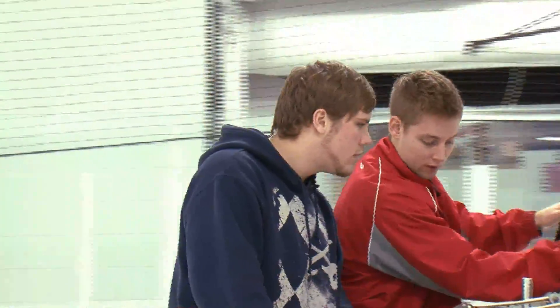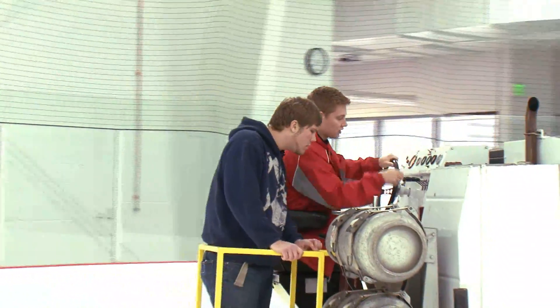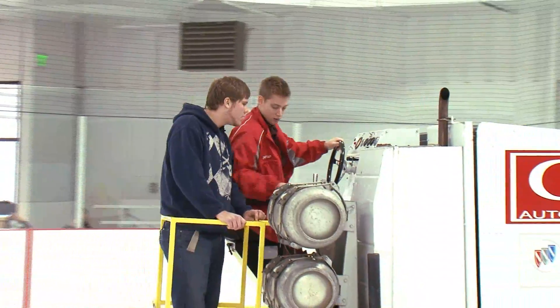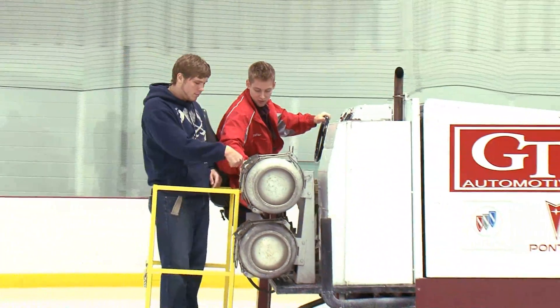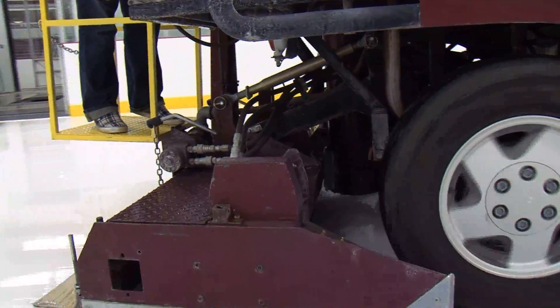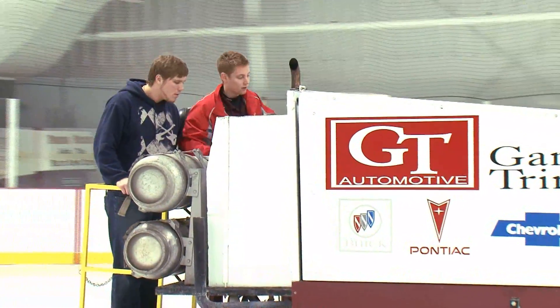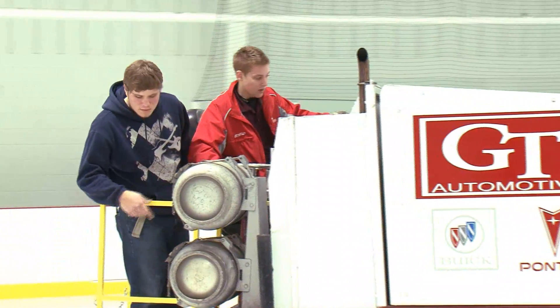Right here's your elevator. I'm going to push this down — it starts the auger. That basically just shoots the snow up into there. Here's your wash water; it sprays the cold water into the conditioner. And turn on your pump right here — that recycles the water back into this tank. And right here's your hot water, the one that lays the hot water on the ice and builds the ice.